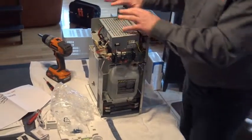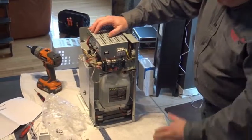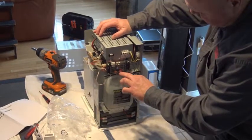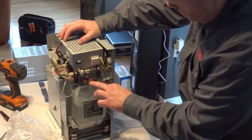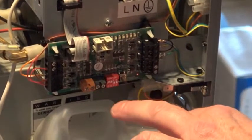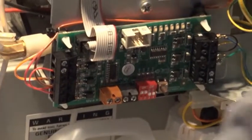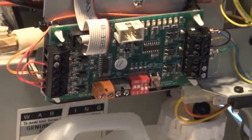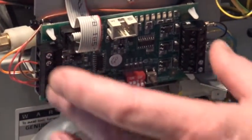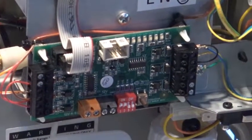At this point, you could put the cover on if required, but we suggest leaving it off so you can watch your interface. This red block here is for setting your time and retrigger function, as discussed in the manual — it's generally pre-programmed for the site the smoke cloak is intended for, so you generally don't have to change it. That's where the dip switch is for setting. The low voltage is already done with our wiring harness for our zero-wire panel.